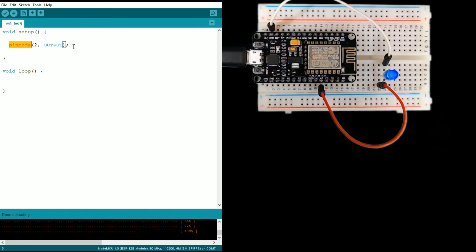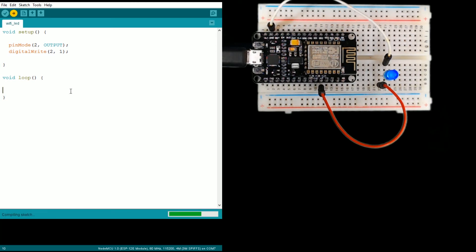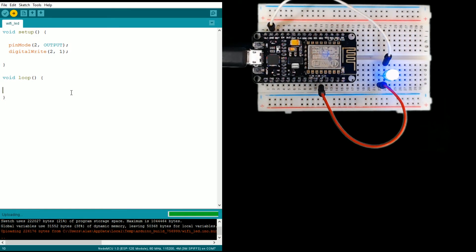We've told the board how we want to run this pin. Now in setup, we're going to send a digital signal to that pin — either tell it to send power or don't send power. We do that with the digitalwrite function, which takes two parameters: the pin number again, which is two, and a boolean value of one or zero, on or off. Since it's already off, let's turn it on — give it a one — and save with Ctrl+S, then upload with Ctrl+U. The light should turn on, and it may flicker briefly depending on how quickly the script gets up and running.